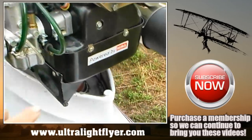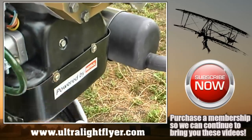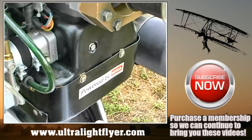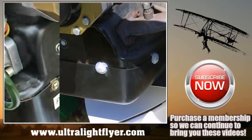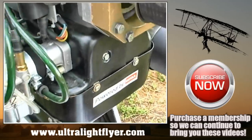The other problem is these little screws. They have a tendency to vibrate out, and when they vibrate out they go through the propeller. What you can do is put a little bit of silicone on them, or some people put duct tape across them.